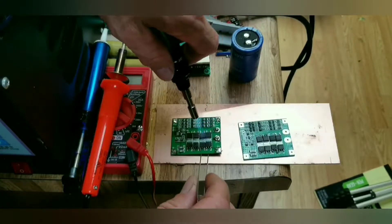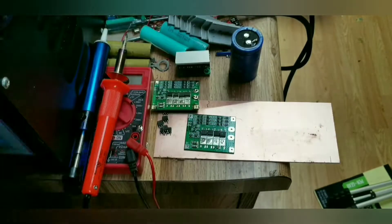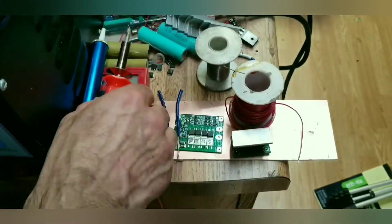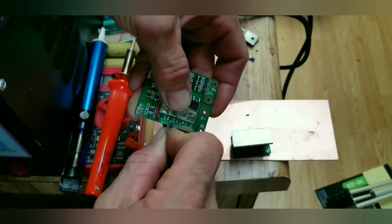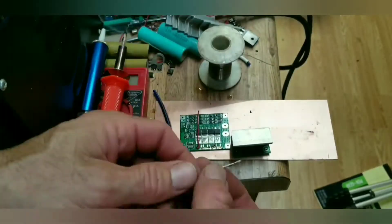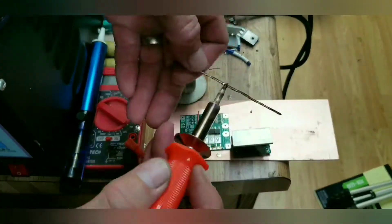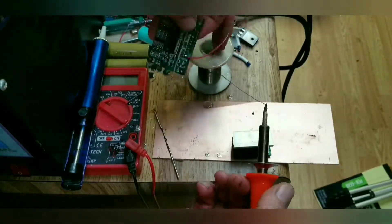Now I need to attach this breakout board to the BMS. I was trying a torch to get all the factory MOSFETs off, and it looked like it worked, but in retrospect it wasn't a good idea — the board ended up being a failure and I had to redo it off camera. I think it was because I overheated something with the torch. So I'm making some pads by scraping off the solder mask and then tinning up a piece of wire to attach. I'll solder these wires down onto the board and bend the ends of the legs up — like table legs with a table sitting upside down. Then I can slip the breakout board down on top, solder it in place, and we'll be good to go.